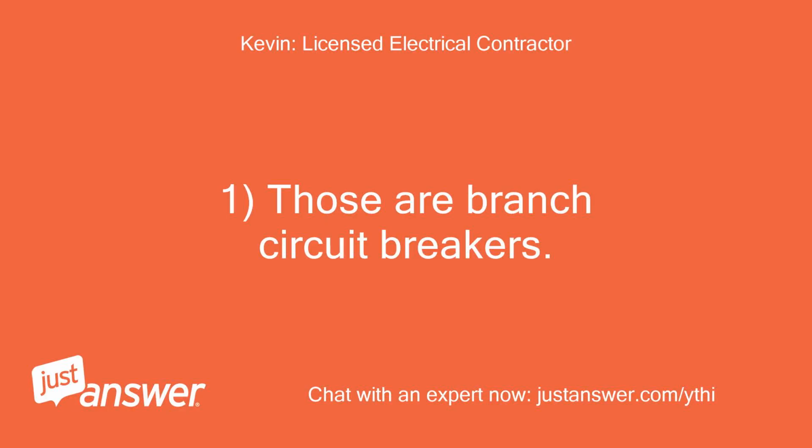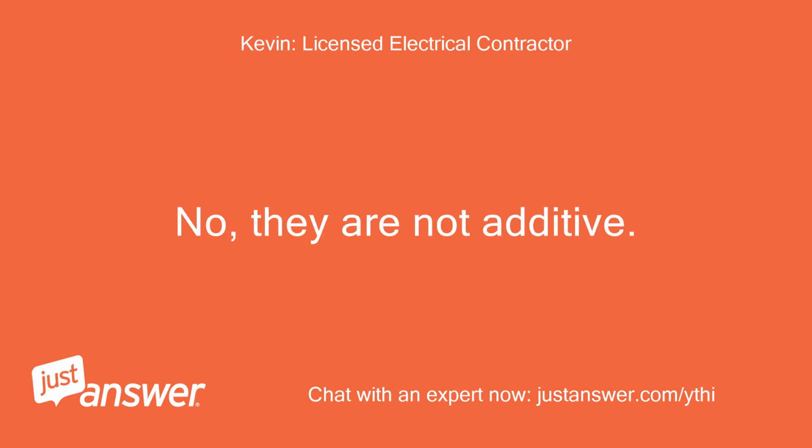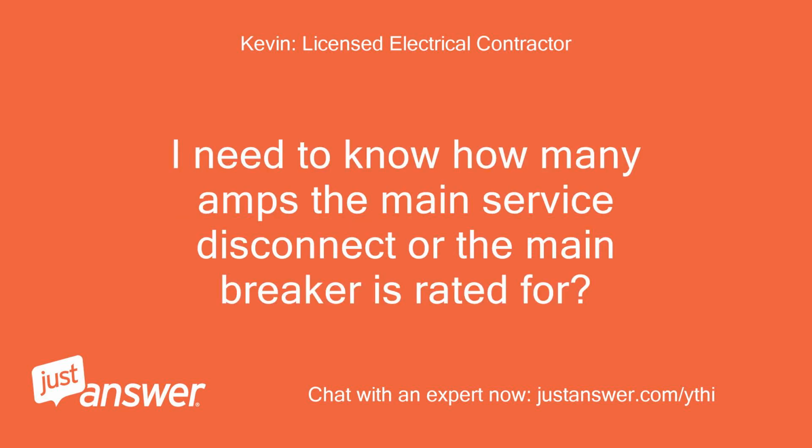1. Those are branch circuit breakers. No, they are not additive. I need to know how many amps the main service disconnect or the main breaker is rated for.